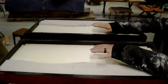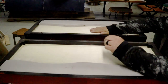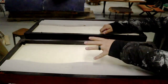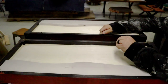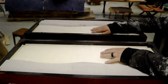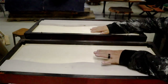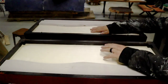I did a rough calculation of how much epoxy I'd need. Whenever you try to figure out epoxy amounts, you take your volume that you want and divide by 61. That gives you the number of liters that you need. Because I'm just doing a shallow pour here, I just figured I needed a 16th of an inch thick. So I did the calculations.